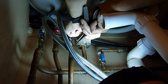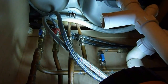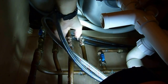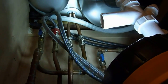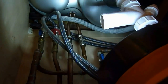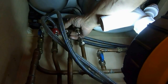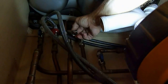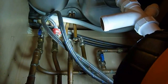Don't worry about the little bit of water coming down out of the pipes - that's what's in the actual taps and in the bit of pipe above, so you're always going to get that no matter what you do. I've already undone this one, so that one should now come out. There'll be a little bit of drip. Just let it finish - put a bit of cloth under there. The tap should be able to lift out now. You can see they're free.